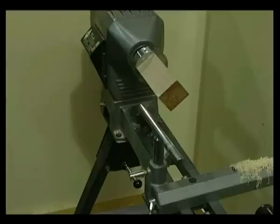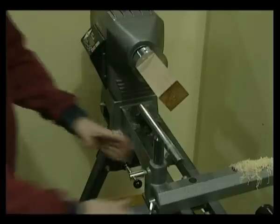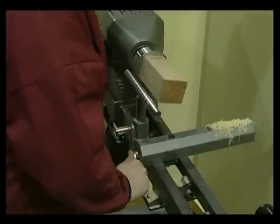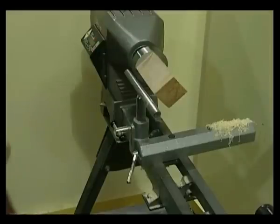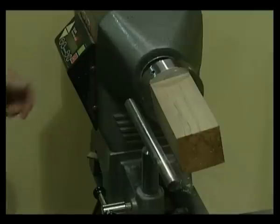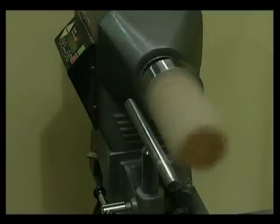In this presentation we will mention the safe tool rest position prior to and whenever any turning is going to be done. The setup for this is: slide the tool rest as close to the workpiece as is safely possible, ensuring there is enough room for full rotation of the wood without any interference. Check this by rotating the wood or workpiece by hand before switching the lathe on. Then turn the lathe on at a safe speed.